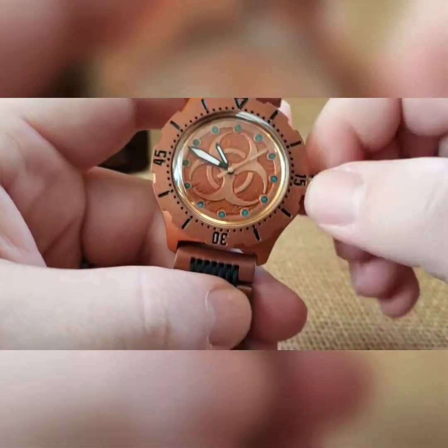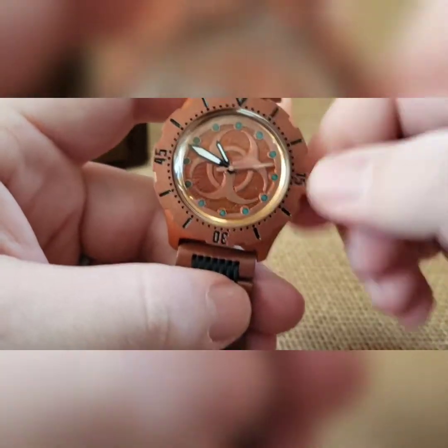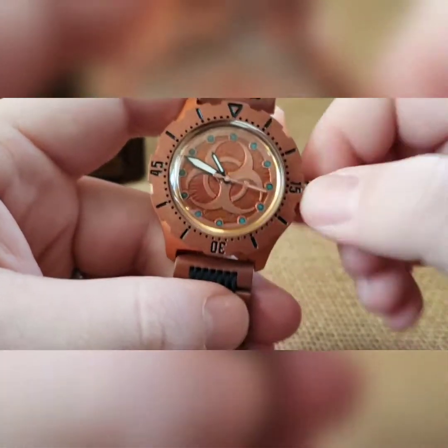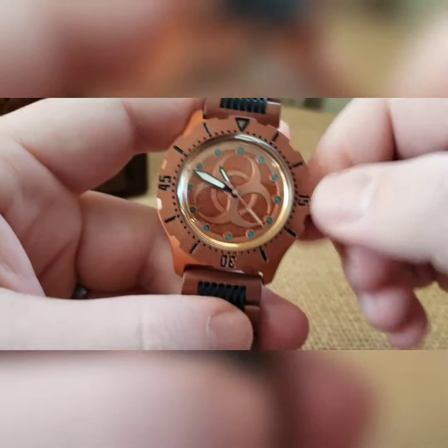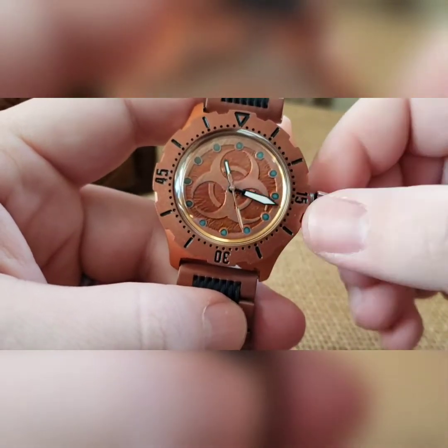It's a lot easier to go back and forth keeping your fingers facing the same way. If you do this for four or five seconds before you put it on, even if you're not very active, you'll keep time throughout the day. If you do it for something closer to 20 seconds you're going to max out your 31-plus hour power reserve. You cannot over-wind it — you can wind it all day if you like. When you're done, pull it to the one and only click and you can now set your time.